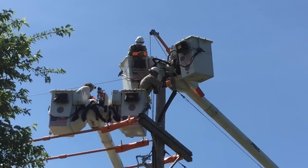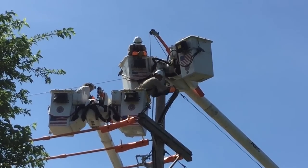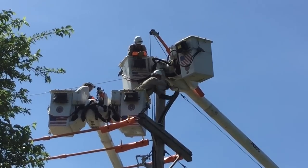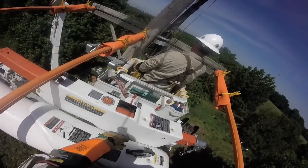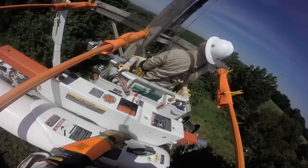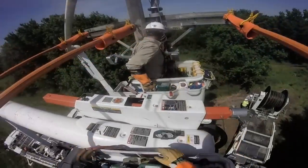Now he's going to install what's called a Kellum grip, which is a wire mesh grip. It's going to allow the guy on top to use a boom to pull that cable into a more direct vertical position. Back up in the bucket, you can see the collar and the plate above it and the grommet in between. He's looking up because they're using the boom up above to pull that cable into position.